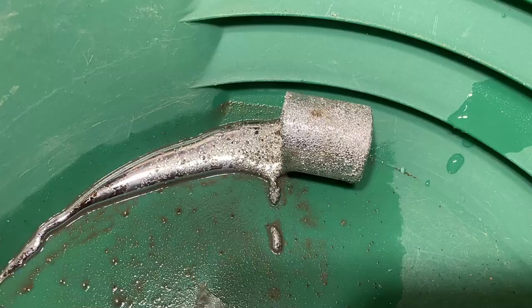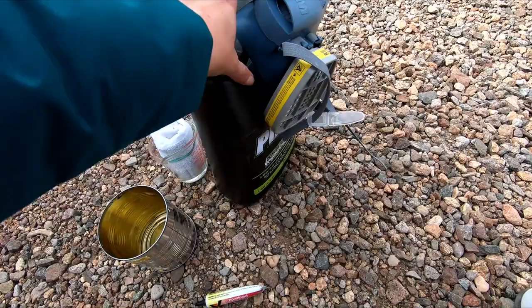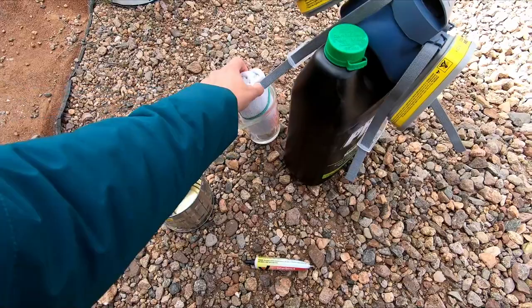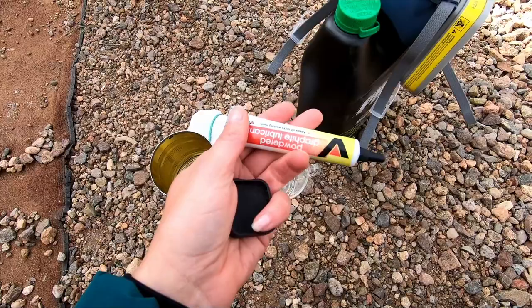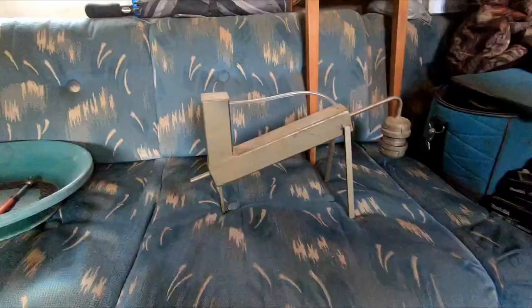I'm trying to turn this amalgam of gold and mercury back into two separate elements — gold and mercury — using a retort. A retort is a safe way of separating gold from an amalgam of mercury and gold, allowing you to reclaim and reuse the mercury. Separating them any other way can be extremely dangerous. Please don't try this at home. Here is all of the stuff I will be using today: antifreeze which I'm going to mix with water, a gas mask for both acid gas and organic gases, a tin can which I need to punch holes in and cut the side, cloth and a rubber band, a Pyrex measuring cup to catch the mercury, and graphite powder so the gold does not stick to the inside of the catchment pot where you put the amalgamation.